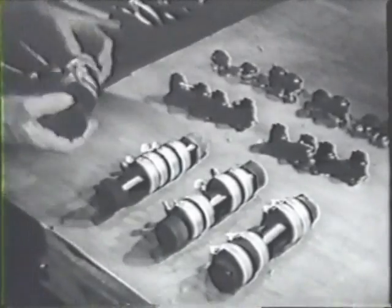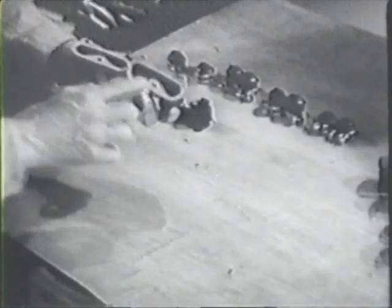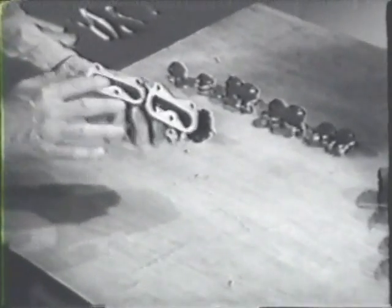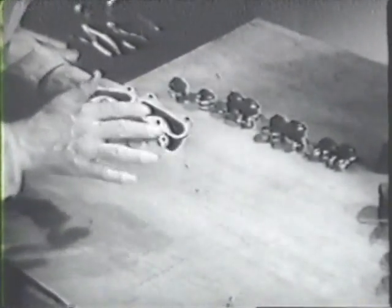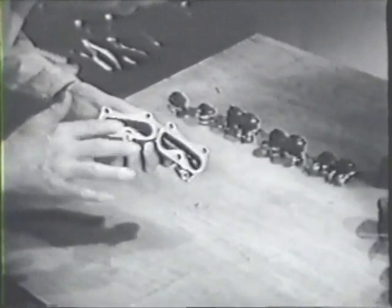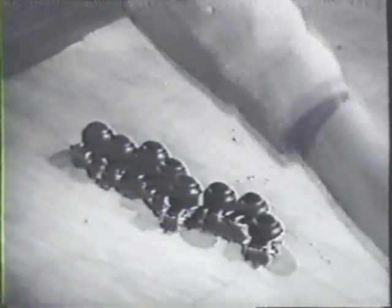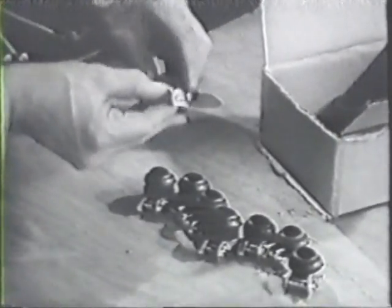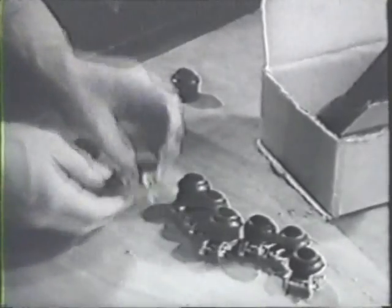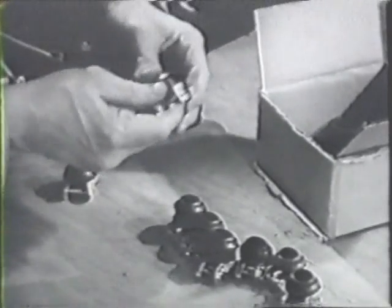When all the intake pipes and their connections have been put into condition, inspect the pushrod housing flanges. Check the parting surfaces particularly to be sure they're smooth. Next, go over each of the eight pushrod connections. Install a new set of rubbers in the clamps and discard the old ones. See that the threads of the tightening screws are in good condition.